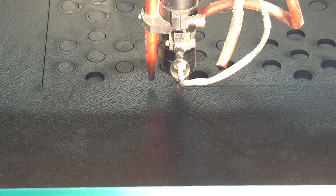As she gets to the left hand corner, that's the finish of the cut. That's the bottom of the box, and then I work out all the rest of the cuts from that. The box is going to be the same size as the other one, but it'll sit 40mm lower in the water. I'll lay it all out on the bench out here in a minute before I cut the sides on the table saw, and you'll be able to see roughly what's going on.